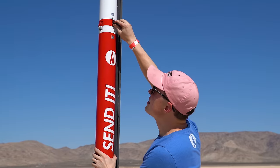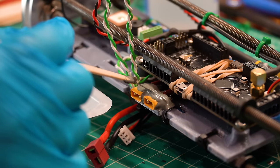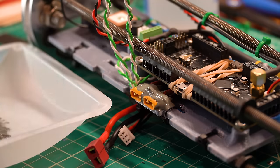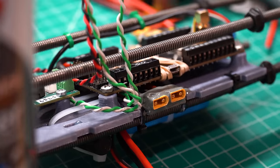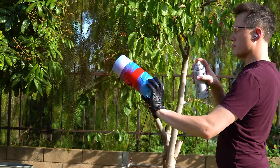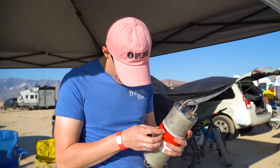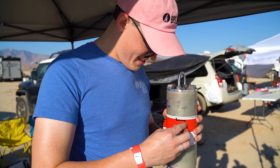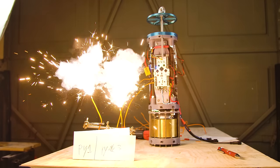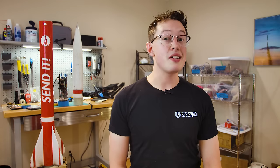The second flaw is that connector polarities should have been swapped — the avionics bay should have the port connector polarity with the hatch having the pin polarity, which would slightly reduce the risk of accidental power-on. With the power hatch and cameras done, I gave the avionics bay one more coat of paint to help the cameras blend in. Overall I'm really happy with how the avionics bay came out — a lot more simple and robust than Lumineer's.